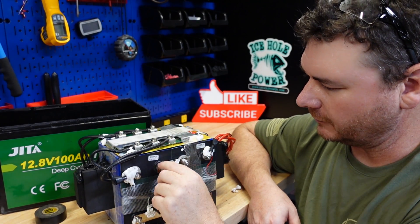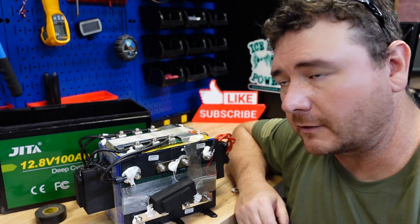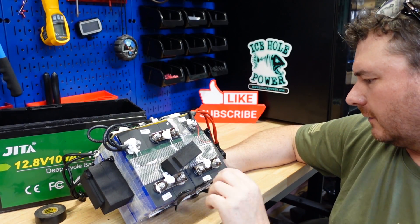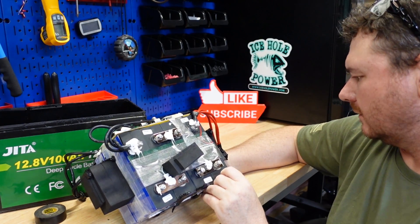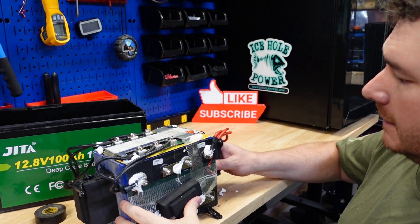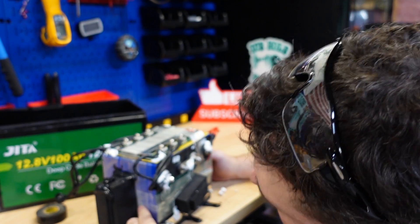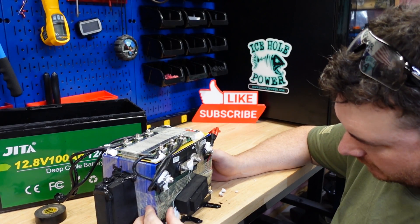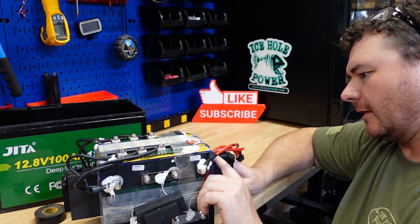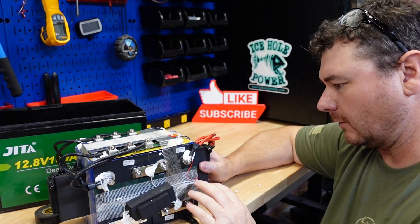All these connections should have silicone on them. They're all tight, at least from what I can tell — all the lock washers are squished down. Cells look decent, they've got dividers in there, they're not bulging or swollen. But yeah, someone dropped that bolt. It did test good at bulk capacity and I don't see any other damage to the cell. I do like that their balance leads are nicely organized — they don't really cross each other.